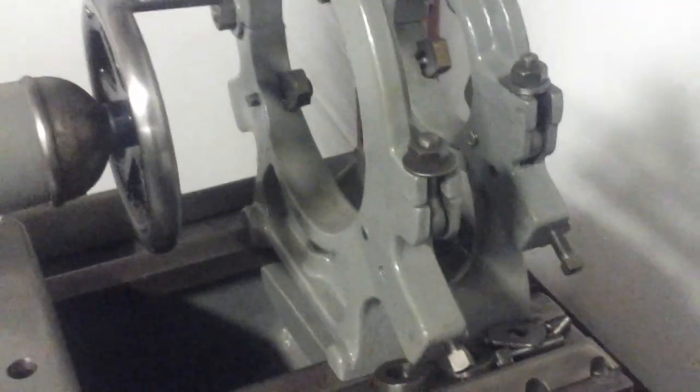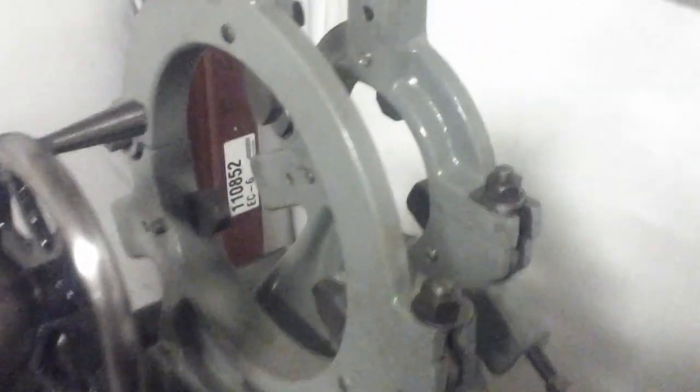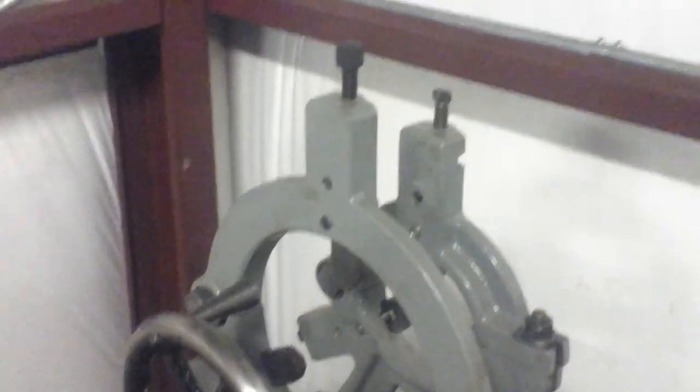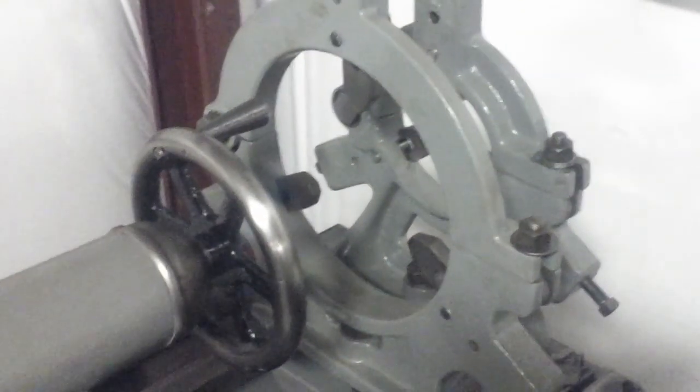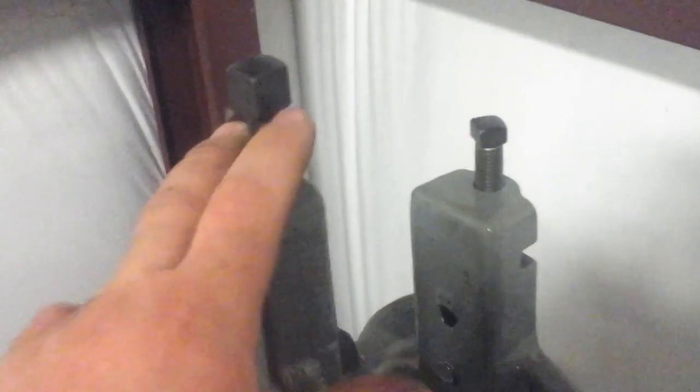See, I got the steady rests both cleaned up. They're both pretty well complete. Originally, the fasteners they used are a little more special. They made it so that all the square head fasteners on this could be adjusted with a 5/8 wrench. You know that some of them are different size bolts, and the other fasteners are kind of all over the place. So like this is an original square head bolt. I think it's a 7/16. This one's got a 3/8 head on it though. And so I've got some blanks cut. I'm going to make some of these bolts so that they all match. Just a little matter of convenience.